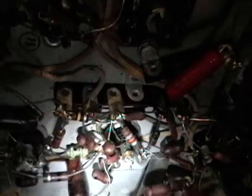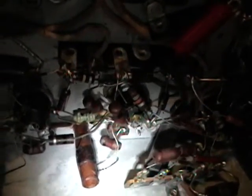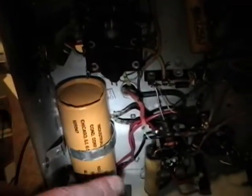Then, with all those capacitors out, it was much easier to get to the resistors. I started testing those, and I actually didn't find too many that were out of tolerance. But those I did find, I did replace. There's one down in here, and you can see these new resistors I picked up — this carbon composition looked quite a bit like the old ones did. Here's another new one I put in place. In here is one of the new rebuilt electrolytics I've wired back in.